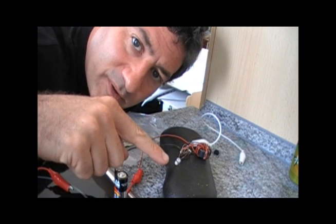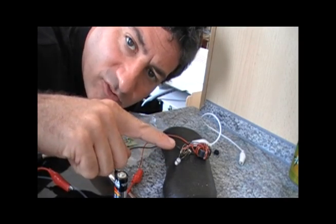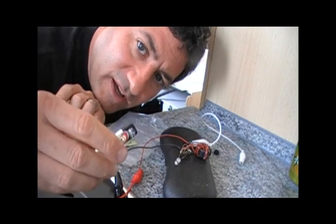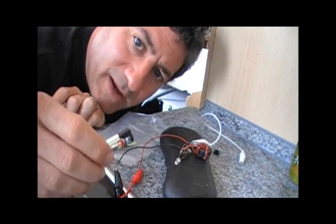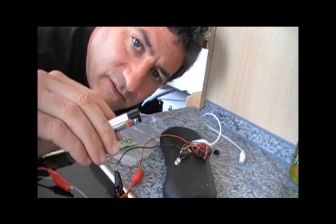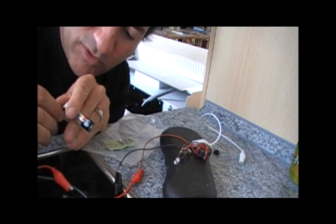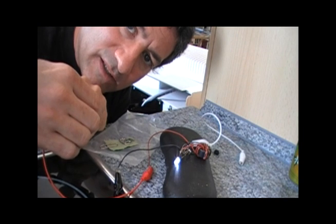This is the typical 3-volt super bright white LED with a Joule Thief circuit. Many people have shown how you can take a dead 1.5-volt battery — dead meaning that it's down to about 0.9, 0.8, even 0.7 volts. I've even done it when it's down to half a volt. And with the Joule Thief circuit, it lights the LED.